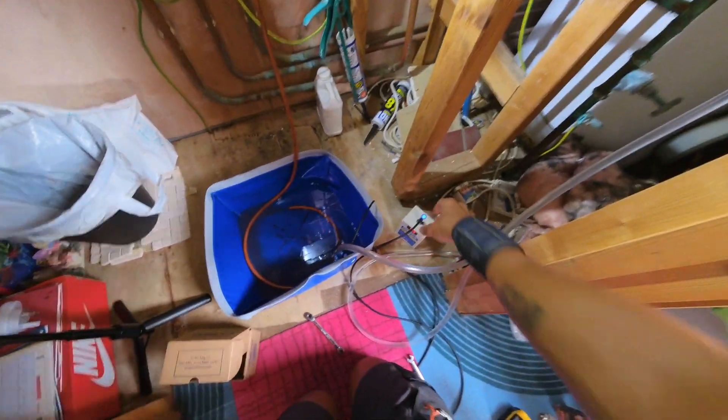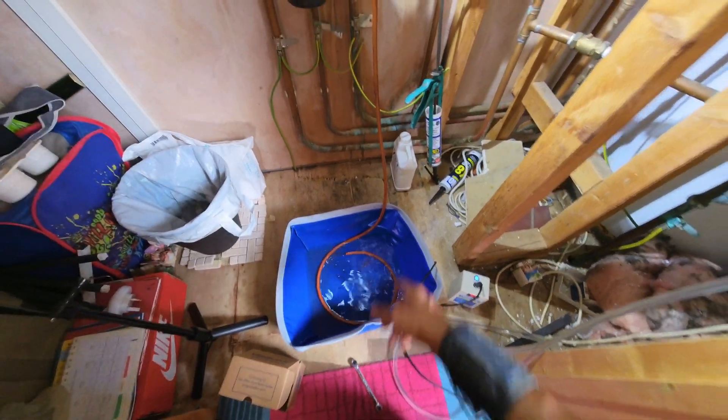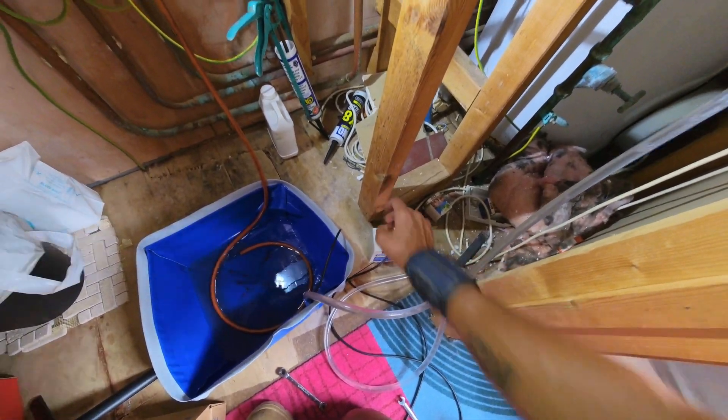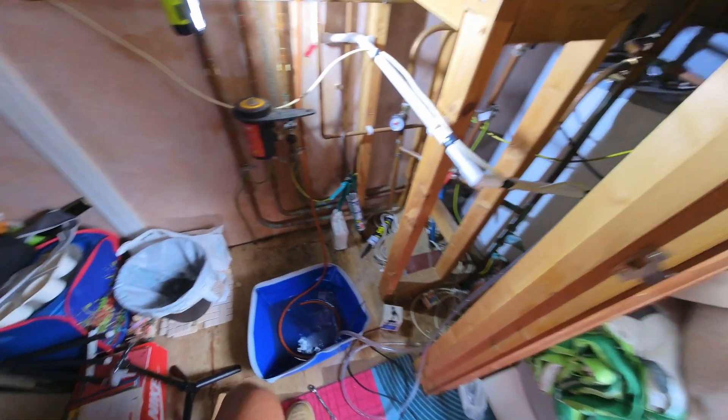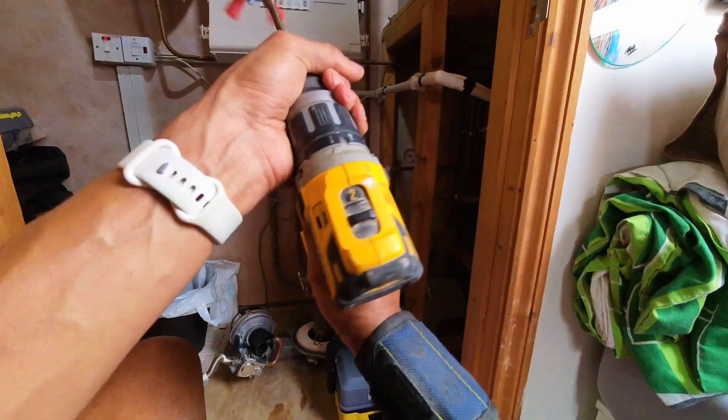The customer's not here — he's at work, his wife's here. I've sent him pictures and told him it's not a good start. Waiting for him to give me a phone call to discuss next steps. We'll do the service and then see what we can do about disconnecting the flue and checking the seals. The blower kit — as expensive as it is — this is one of those situations where it comes in proper handy. Working up in a loft, rather than having to drain everything and take it all downstairs, the hose just goes straight onto the waste pipe and it's literally just pumped all the water out into a little folding bucket. Wicked bit of kit.